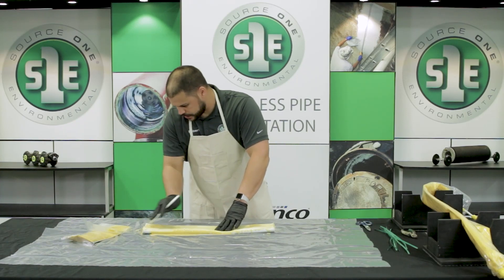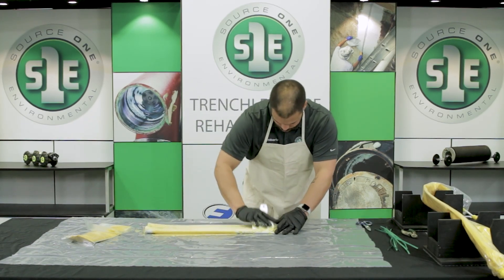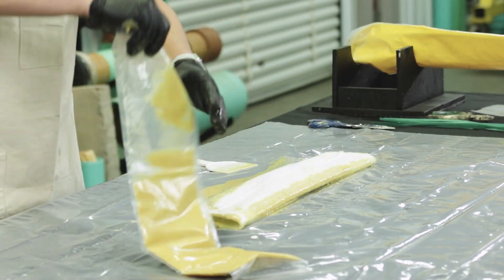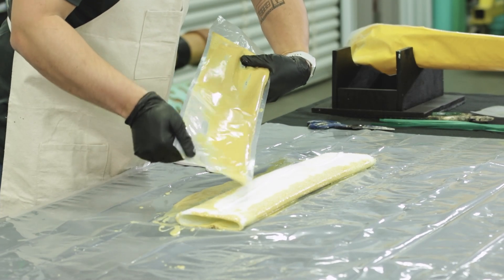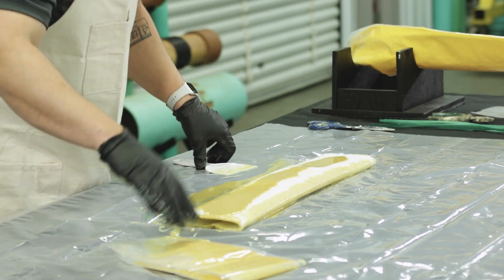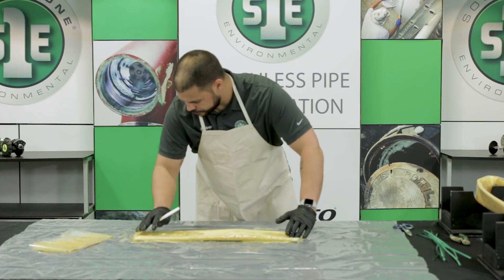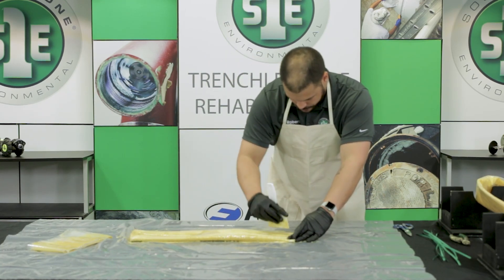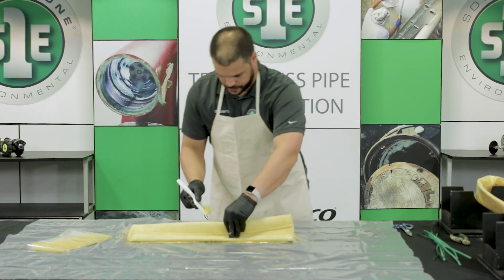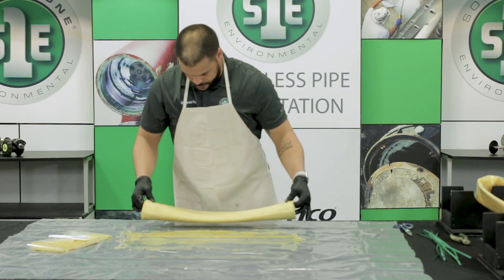Don't want to scrape the resin out of fibers — you just want to move it from one end to the other. Once that side's done, flip it over. This is a little different than our normal fiberglass, so depending on the size kit you actually may not use all the resin. You can work it from one end to the other. You don't want to have any pulling on here, so any of the excess, lightly run the spatula down and get all the excess off. Now we're ready to load.